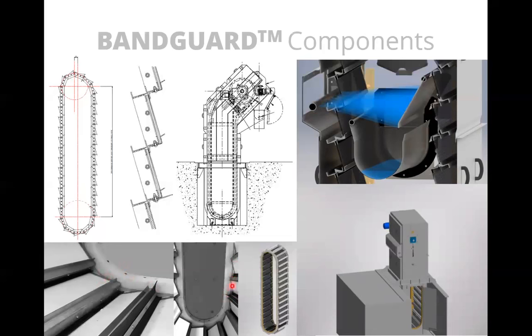You can see the shape of the inlet chamber here. So these panels rotate like that and carry the screenings upward. You can see on occasional panels, there are teeth that stick out. So what these do is they pick up screenings that may have collected in the inlet chamber, and they'll carry up bundles of screenings up to the top and discharge them into the launder. So this is what the band looks like when it's removed. And so quite a simple operation, quite easy to understand.